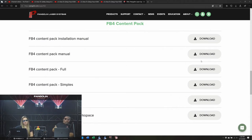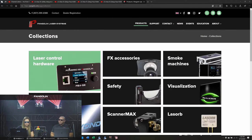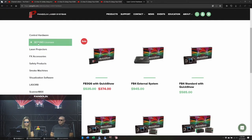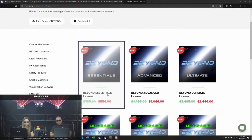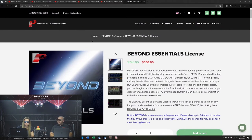The diagrams are going to show you every possible setup — doesn't matter if you're using an FB3, FB4 external, or FB4 integrated into the projector. It's going to show you every control cable and every setup you may encounter. Independent versus shared control is a big question we get, and these speak to that as well for each piece of hardware.